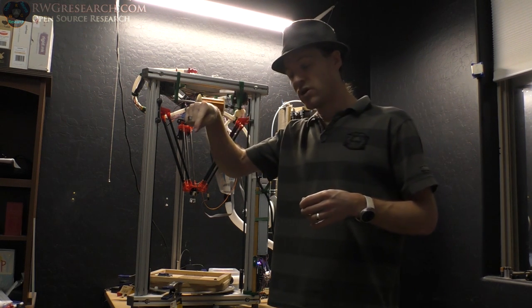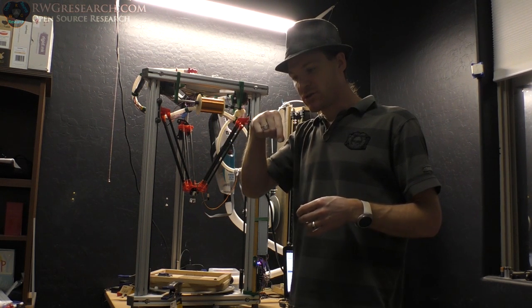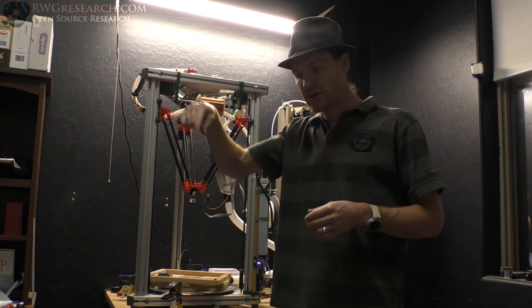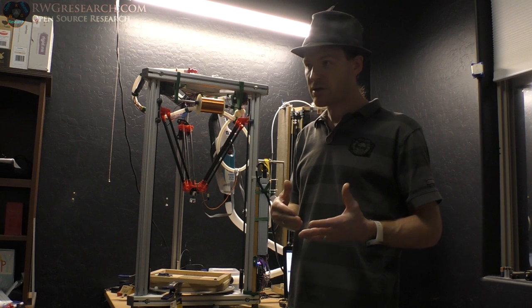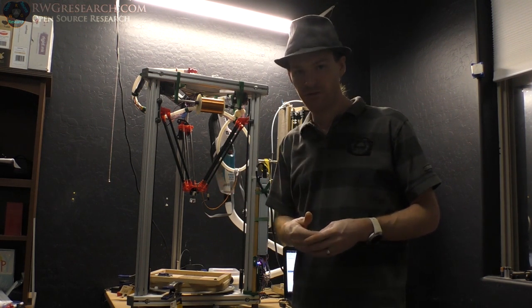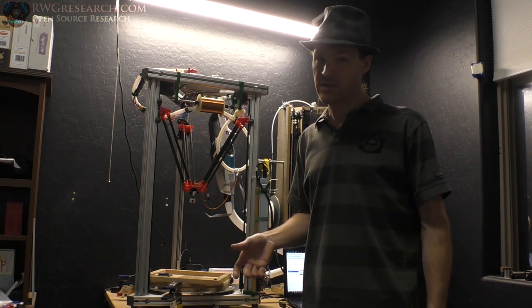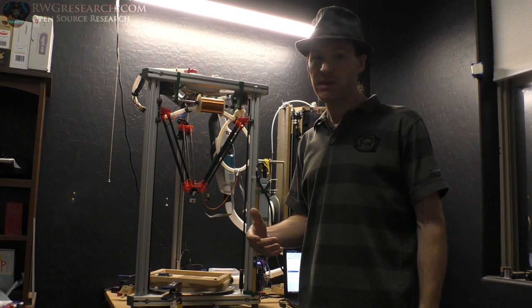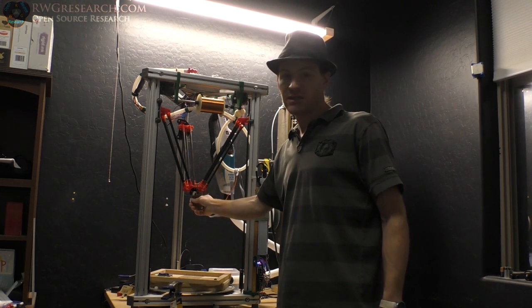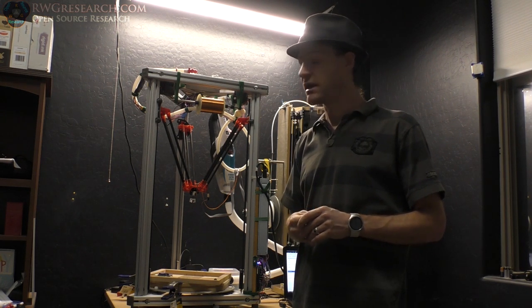So when we put a U command on an individual line, it kind of like just jerks like this as it goes around to each point, and that's not good. But if the axis moved very fast, the rotational axis, if it moved real fast, it would be more fluent. And I'm actually limiting my speed factor because I can only spin this at a certain rate, which does not go very fast. So I'd like it to run a lot faster than that.